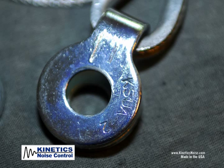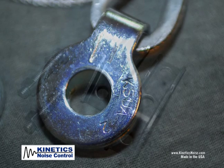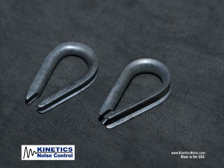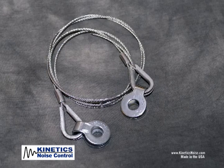The KSUA bracket, for attachment to structure and ductwork or suspended mechanical equipment. The KSCA bracket, for attachment to clevis hung piping. Thimbles for use between the cable and attachment brackets. 15 feet of pre-cut cable with swaged loop on one end.